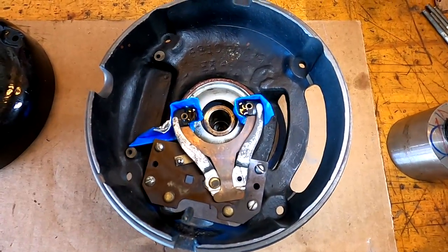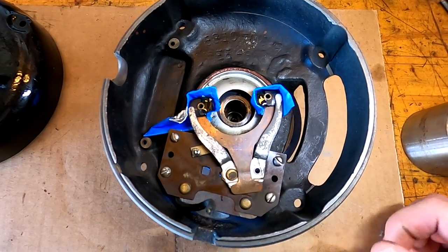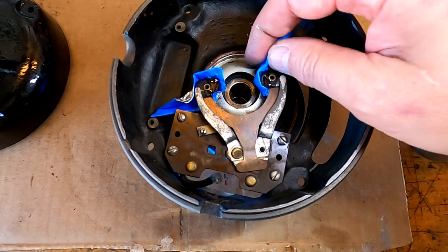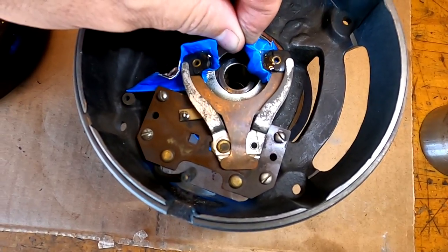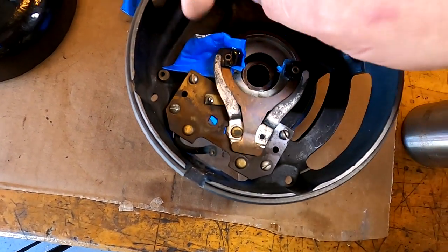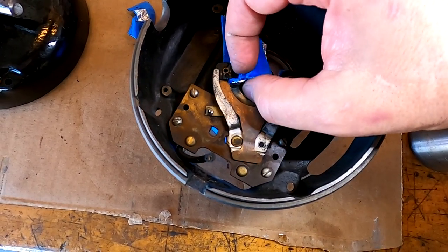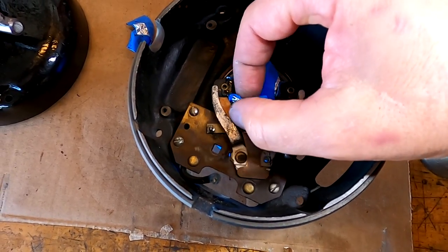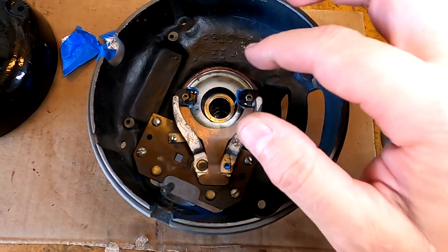Okay, so last night, in the middle of the night, I woke up. I remembered I forgot to put the epoxy in here at these points to build that up. So I came out here, I got some tin foil, and I wrapped it in tape here because I didn't want the tin foil to stick to the epoxy. I don't mind if the tape sticks to it. And we're just going to pull that off of there. And the tin foil allows it to maintain form. And of course, the tape is easily ground away. I don't want to risk having metal in here, being that it's a motor, it's electrical. So get that out of there. Now, all this can be ground free, so I'm going to get the Dremel tool and grind that.